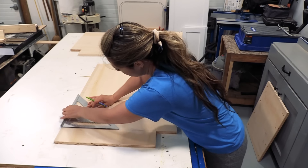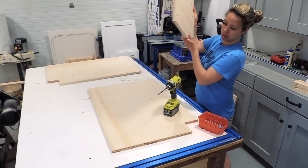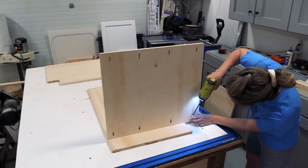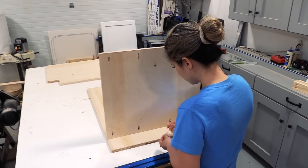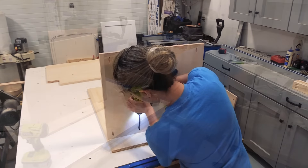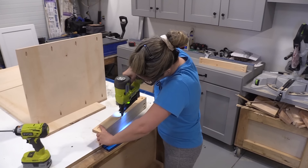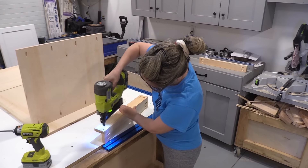First, I'm going to attach the bottom shelf, making a line flush with the bottom of that toe kick. I drilled four pocket holes on each end of the bottom shelf and then just attaching on the line. I like to draw my line on the underside of the joint because I can see the line as I'm attaching. I recommend pocket holes because it's a very professional, high-quality way of attaching your cabinet together. But of course, there are other means — you can use screws, or I even know carpenters that just nail their cabinets together with glue.